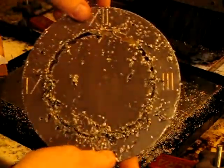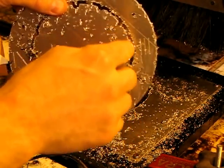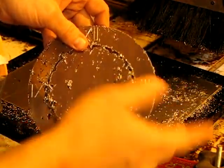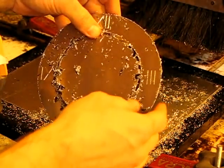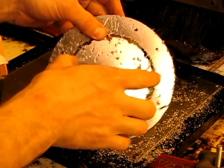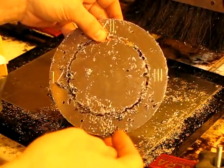Here I have my clock face. You can see how this part is hanging on. Generally when you're cutting a piece on a router you want to have a little tab for something to hang on. I attempted to do that here but apparently didn't do it quite right. The reason for the tab is that if you cut the piece free and then air blowing past the router shifted it over, and you wanted to plunge cut, if it went somewhere else and this thing starts spinning, that could be a problem. But we didn't have any problems this time.